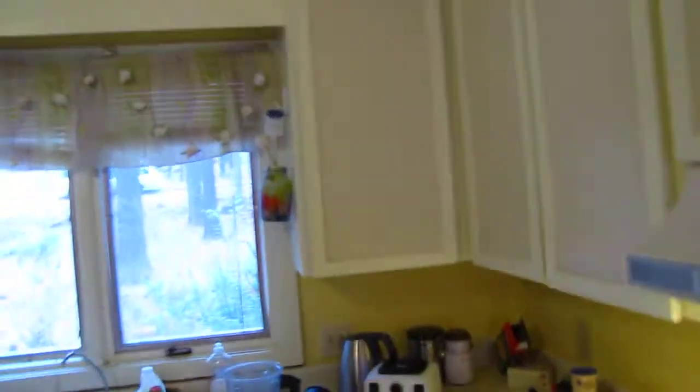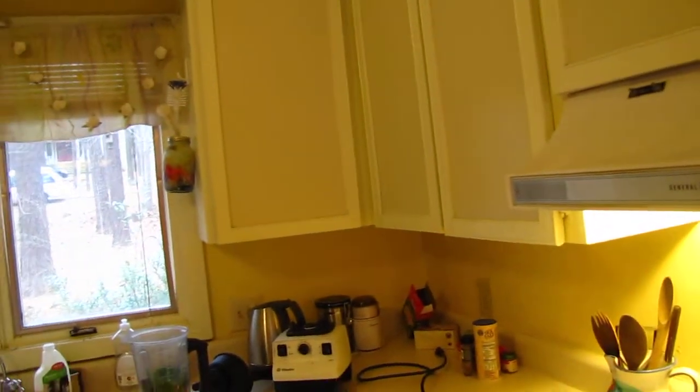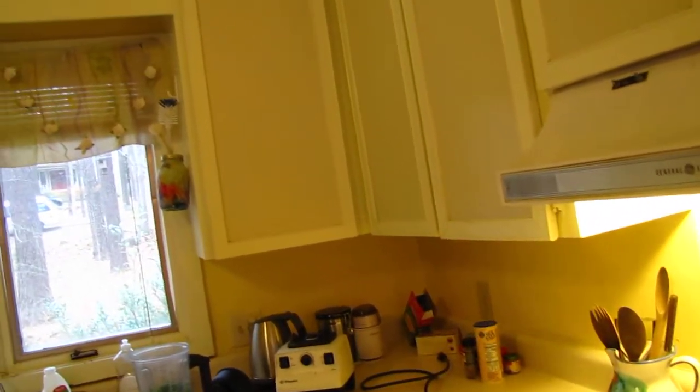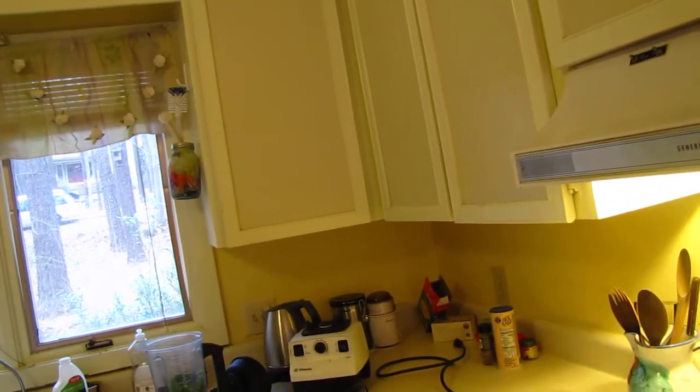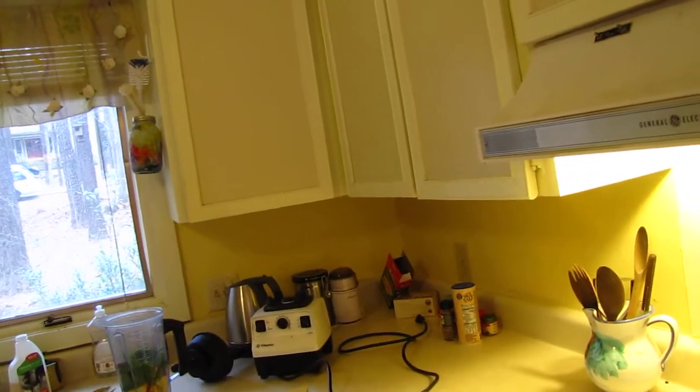That is the doors, the interior. Will TSP clean everything real well, underneath as well? And I'm going to say that if it is white — and I'm going to call that color lavender — if it is white or lavender, then we would need to clean it, sand it, clean it, and get two coats of paint on it. And if we find bare wood, then we would need to prime that. And we will find bare wood on these areas where we were sanded, like this.